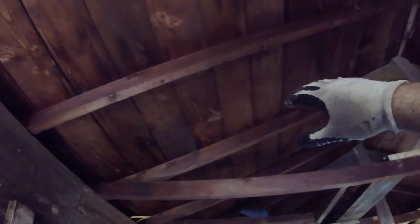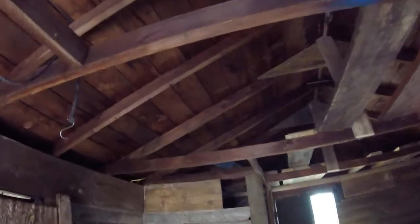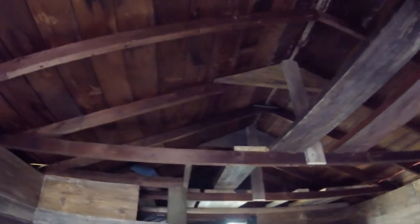And since I'm already going to do that on the outside, I won't necessarily have to do it on the inside here. So the roof will be a lot cooler that way, actually. And I won't need as much insulation, because normally a roof would need about R30, I think. I don't need to do that since I'm going to do the inch gap outside. I made a decision that I'm just going to go ahead and put my, I think this is R19, so it'll be just like I did the walls. And then I've got some sheetrock I'm going to put over that.